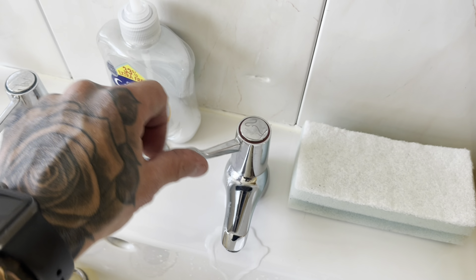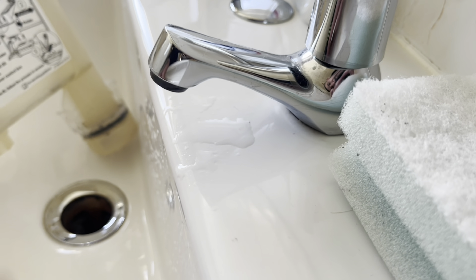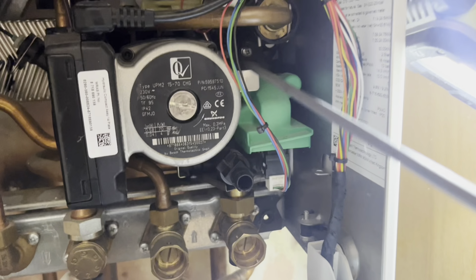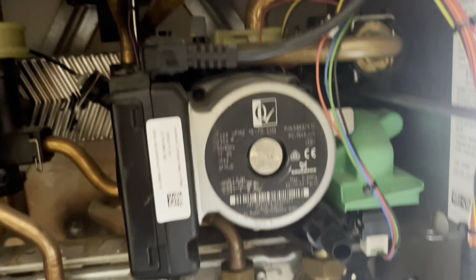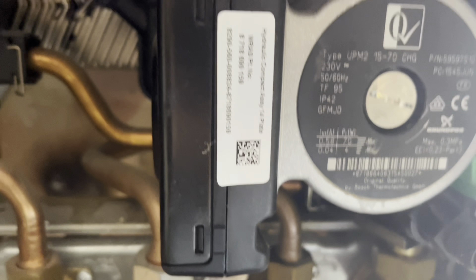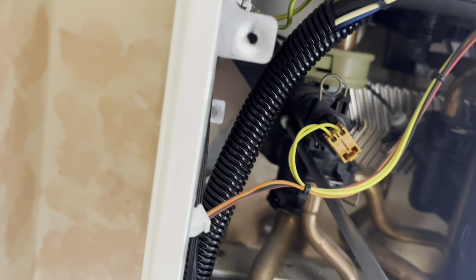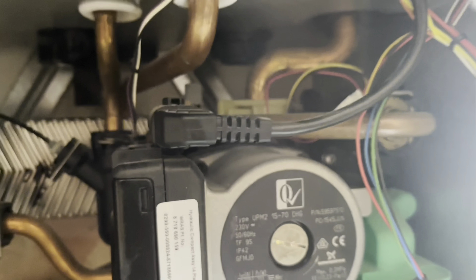Open the tap to relieve the pressure off the hot side. You've got two posi screws — one's right back there and the other one is just tucked away underneath the hot water pipe. Be prepared for water to go everywhere, because you can't really empty these properly. So I'm slacking these off a little bit first, and then pushing on the screw to try and empty out any more water. Got a towel at the ready. It's going to be sharp and hot, so I've put gloves on at this point.